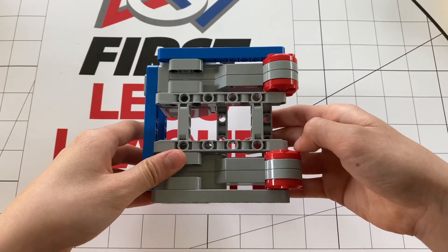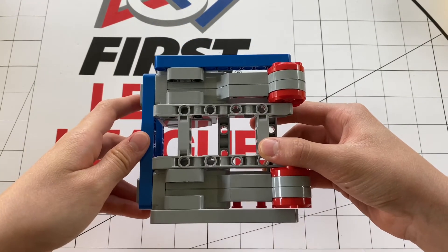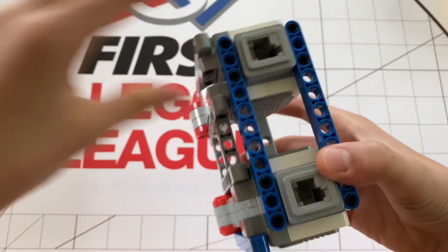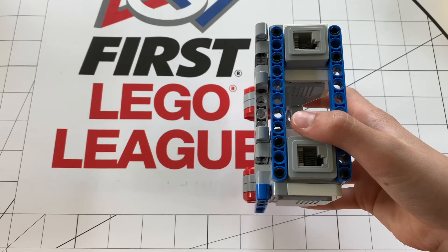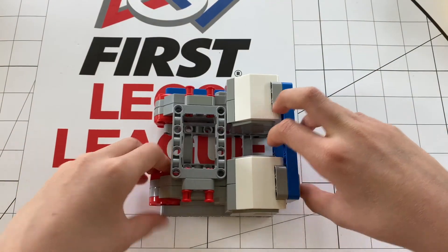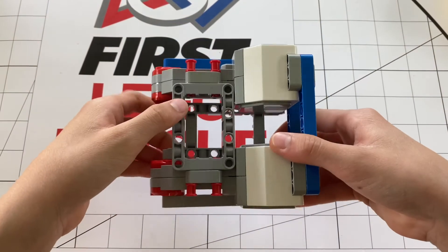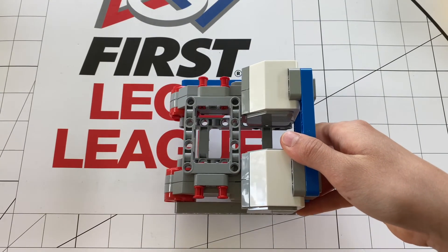For the flipped horizontal setup, I really enjoy it, but you'll have to use large wheels, which makes your robot less accurate, as I stated in my best wheels for your FLL video. This can be a problem for many people, including me, who don't want to write very large programs to make your robot more accurate. For the vertical alignment, it makes your robot very tall and I really don't like that in FLL, because you can make things shorter, but you can't really make things too tall. So which one do I like best? Honestly, I would probably go with the flipped horizontal alignment. You can also use different wheels for it, which makes it great for FLL. For any beginners and intermediates though, I would try to use the basic flat alignment, because you can still make a very good FLL robot out of it, it's easy to use, and all wheels can go with it.